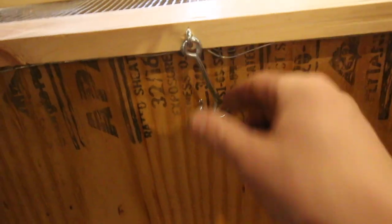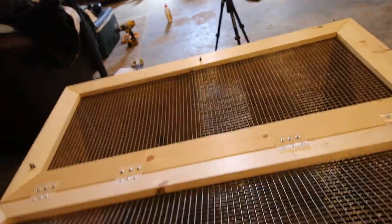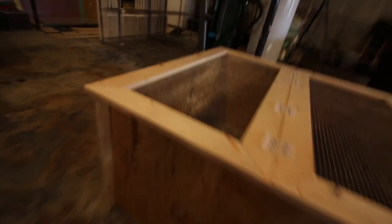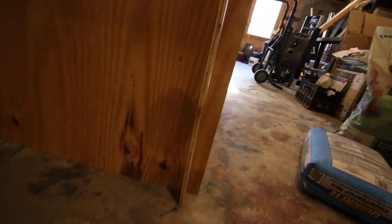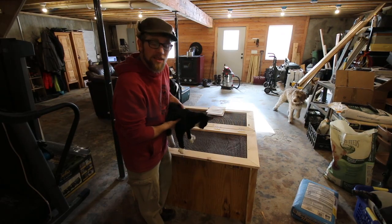It's a crazy mischievous cat. I'm putting a hook and latch on it to keep him out, but the duplex nails keep it locked in place — you can't push it off. One last thing: when you're putting it together and deciding what is the front, if you're going to put a latch on it, make sure the board on the side has the notch on the bottom so it can't get pulled up and out. If the notch is on top you could just pull and slide the whole thing out.